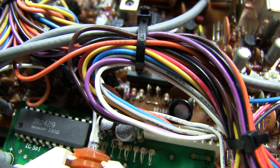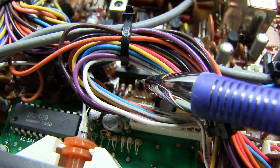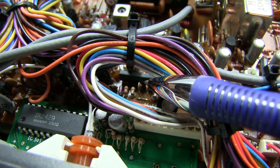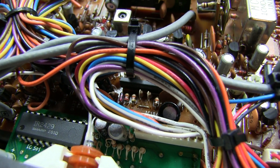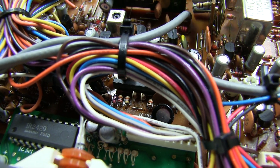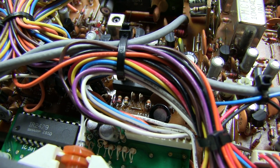The radio transmitted after that. Luckily, we didn't have to mess around with yanking out that 9-pin single inline dual op-amp package, because that would have been a bit of a mess. The problem turned out to be quite simple — a shorted electrolytic capacitor.